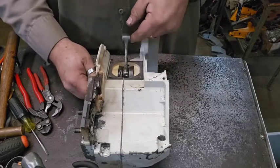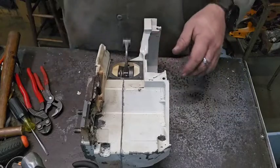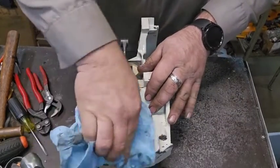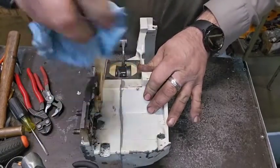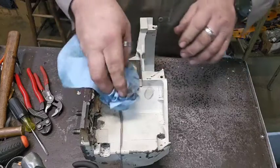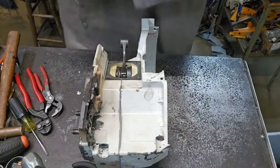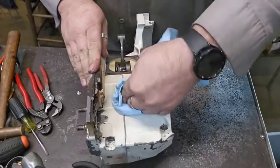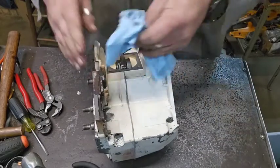She rotates. We got our gasket. I tried to offset the gasket just a smidge so that it would be just a little bit higher than the cylinder here, and looks like I got it. I'm just trying to wipe some of the excess gray off the cases, because I put it on there pretty heavy because I don't want it to leak.